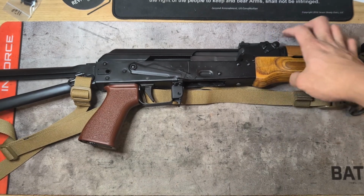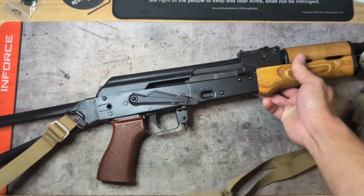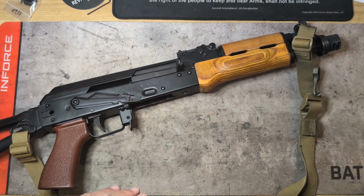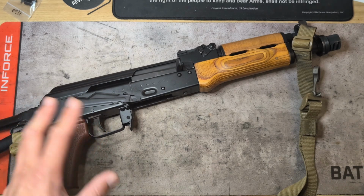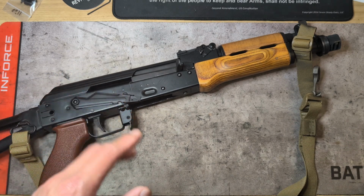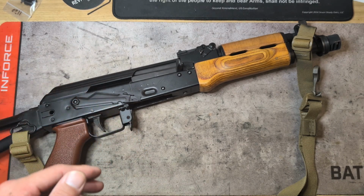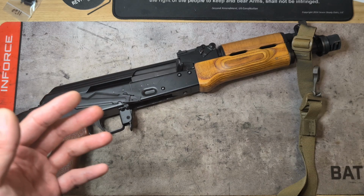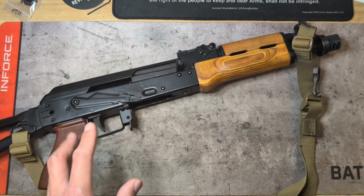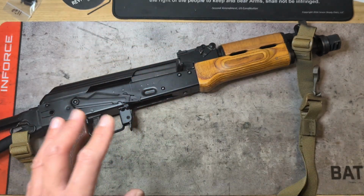But that was my experience with getting the right K&S piston for this gun. Kind of sucked. What really sucked is basically I ended up paying for it twice. But just like any other K&S piston, they do make a big difference in both feel when it comes to recoil, along with the shell extraction. Now, pattern, how far it throws, that's really only kind of interesting, but I think what's more important is that the trunnion's not getting beat to death as bad as it would be if you're using the OEM piston, which typically is really overgassed.